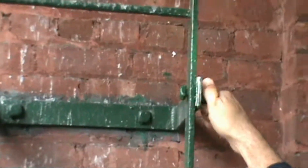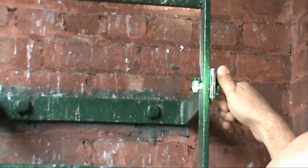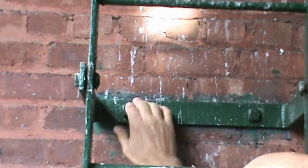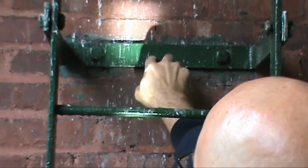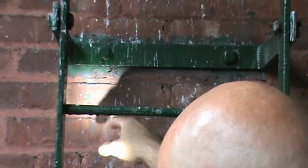Original hardware here, as you can see. I can move the bolt with my finger. Whenever you have original hardware, you gotta reinforce it or just swap it out. So swap out all these bolts. These need to be confirmed that they're tight to the building, and create a little pull test on this. Otherwise you can put a new clip on top and just reattach and leave these existing, seal them up with silicone. Original hardware on the ground. Once you've confirmed and certified the connections, seal it up with silicone.